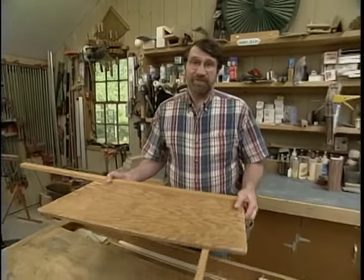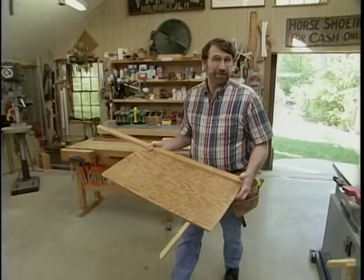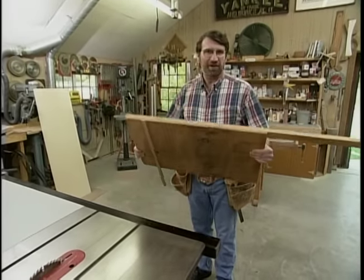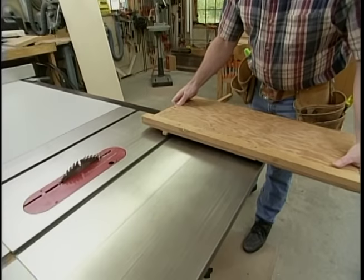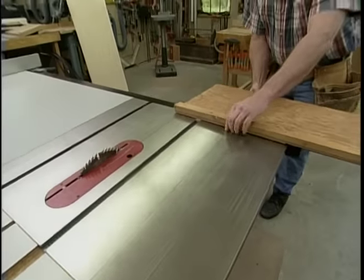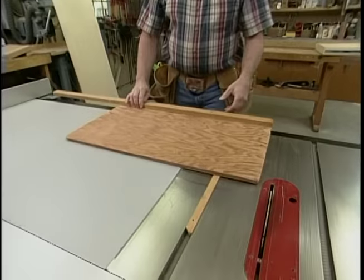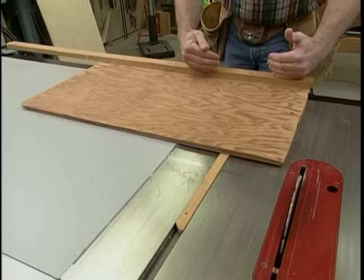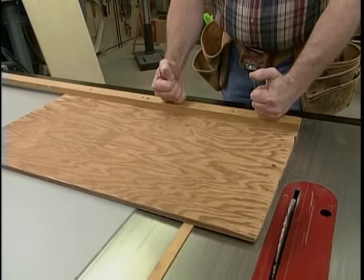You can buy a commercially made panel cutter. They're expensive, and they're heavy, and they have more features than I really need here in the workshop. The key is to have a very lightweight jig — you'll use it all the time, because you won't be dealing with something that's heavy and bulky. Now this jig was meant to ride on the left-hand side of the saw blade. I'm going to make a different version this time, flipped around so that it's on the right-hand side of the saw blade. That'll give me full support, and it also means that the panel I'm cutting will be up against the fence and stay nice and tight in position as I push it through.